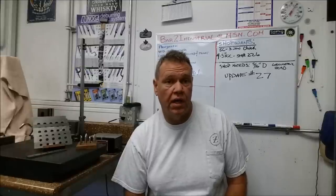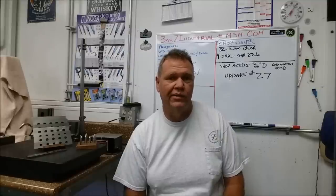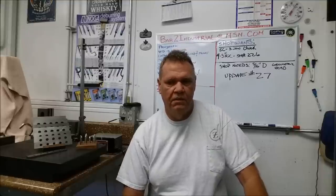A fellow YouTuber and Facebook friend, his name is Mike Galusha — I posted over on Machining YouTube that I was in the market for a BXA setup for my lathe. Whatever knucklehead set up that lathe, it came with an AXA on it. Most of you know AXA — you're limited to half-inch tooling, which means if you're going to use CNMG you've got to make your own tools. Someone went cheap and put an AXA on it, but the machine will take a BXA. I posted that I was looking for a BXA tool post and holders, and he said 'I've got a BXA, I'll send it over.' It turns out he sent me a parting holder too.